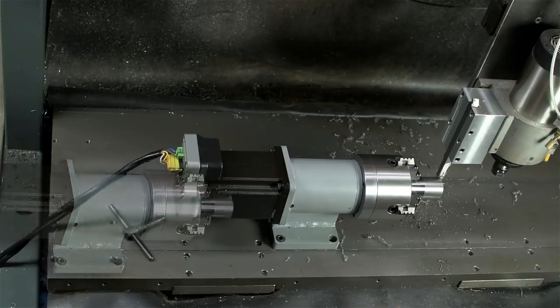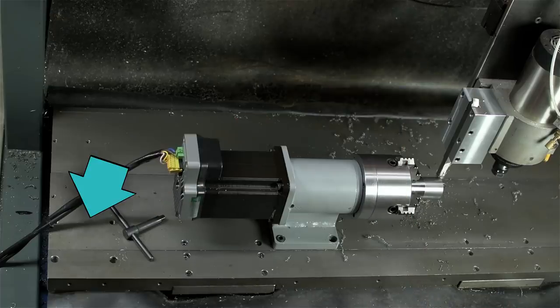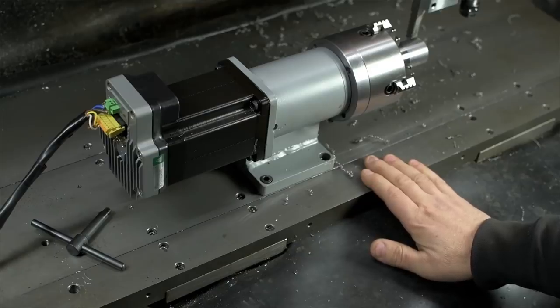And I'm thinking ahead potentially to projects like maybe wood stocks or a couple of those leg lamps. Something where I'd need the entire width of my router. But for steel, that's maybe not the ideal location. That's probably the point of minimum rigidity. So the two rails are here. There's one here and one here with the lead screw in the center. The ball screw's on center.